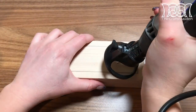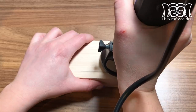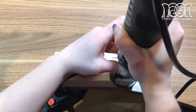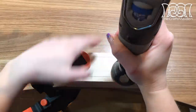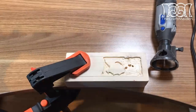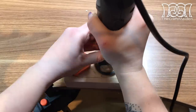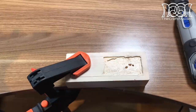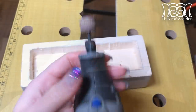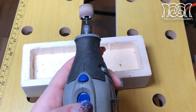To start the cutting you should put the Dremel at a 45-degree angle and let it work its way down into the wood. Depending on what kind of wood you are using it might help to only remove it layer by layer if it's really hard. Letting the cutting bit take its time working through it will also minimize breakage. The edges can be kind of rough afterwards, so to make them nicer I used the sanding attachment.